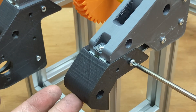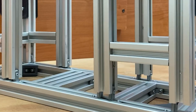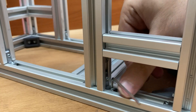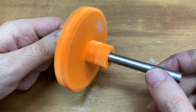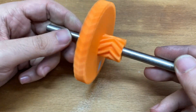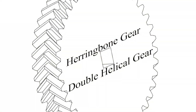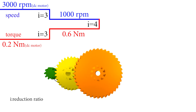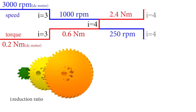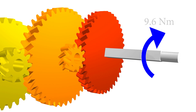Now I have to move on to the other gear stages, but before that I assemble the base and the body. I don't use bearings on these shafts — I just put the gears on a fixed shaft because the friction is very low and they spin freely. I apply some grease. I chose herringbone gears because axial movement can cause problems. The total gear ratio of the gearbox is 48, meaning the output shaft speed decreases 48 times compared to the input shaft, rotating at about 60 RPM.